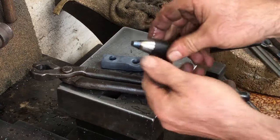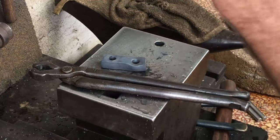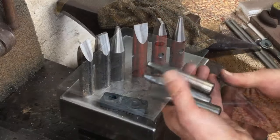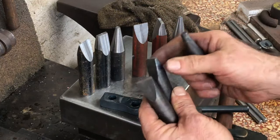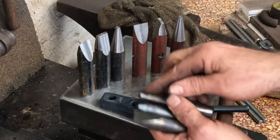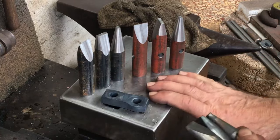Stainless steels are excellent at resisting corroding due to high heat or fire, but they're definitely not suitable for use in blacksmithing, at least as I see it. When you have high heat plus pressure, they don't have the shock resistance that something like H13 has. For now, for the stuff I sell, I'll stick with H13 here. We've got a lot more fooling around to do.